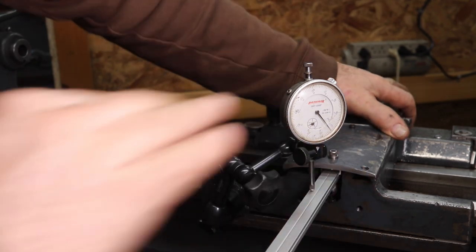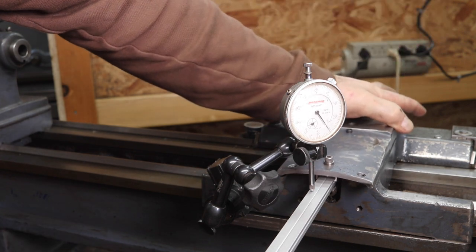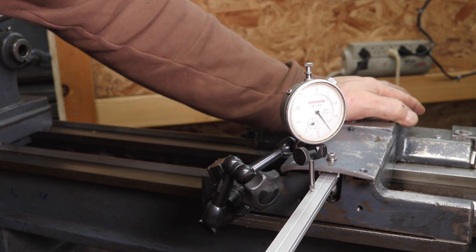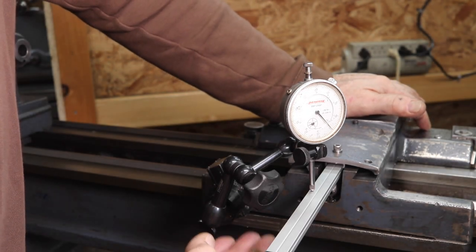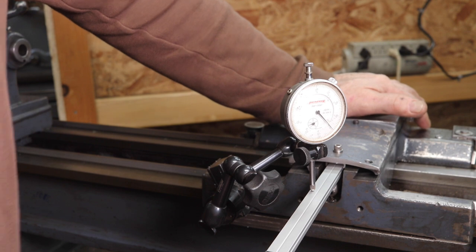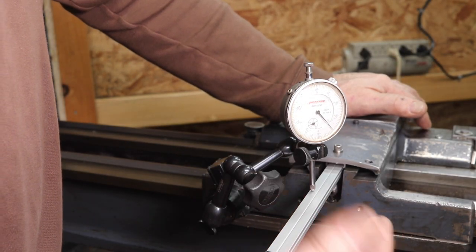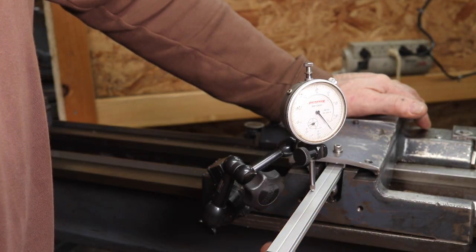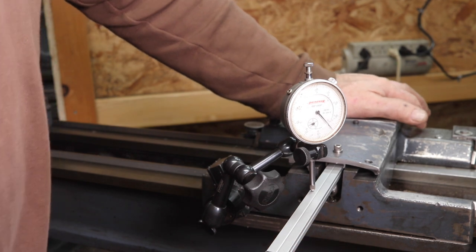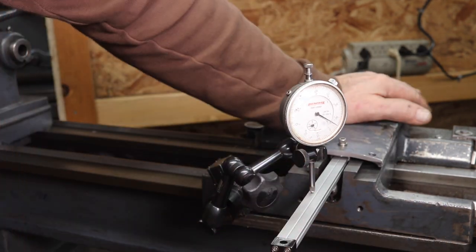On the vertical side we'll just choose a zero point. It's a little off — about four thousandths in about three inches. But you're going to set your head anyway; it can be ten or fifteen thousandths off the scale itself. It doesn't have to be tight against it. As long as you get a good reading, the unit doesn't have to ride right on the scale — you actually don't want it to, to avoid wearing that thin stainless strip. As long as there's enough clearance that it's not going to rub, it works just fine.